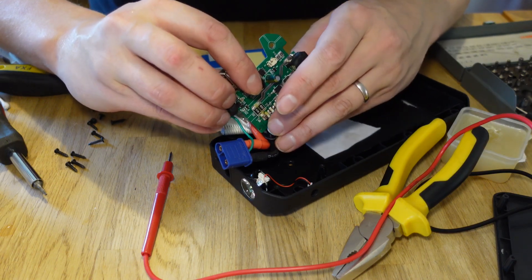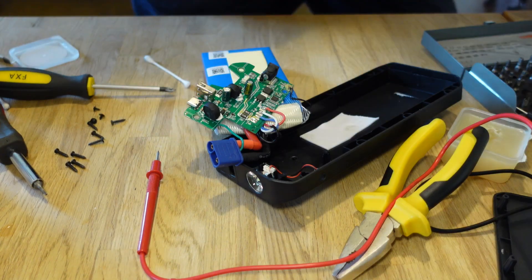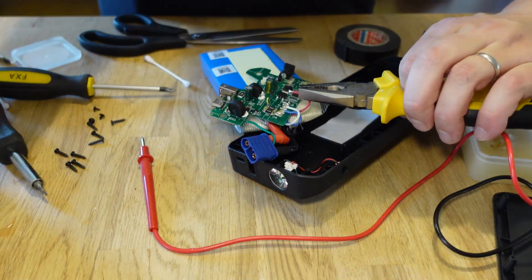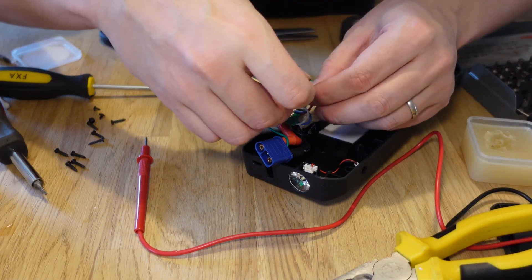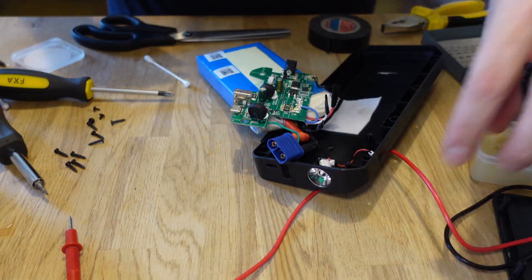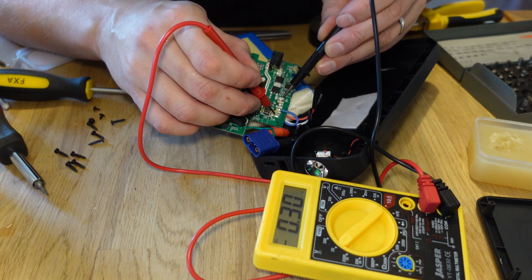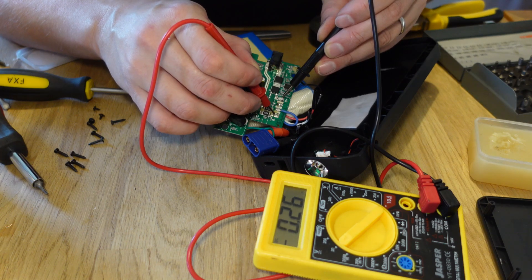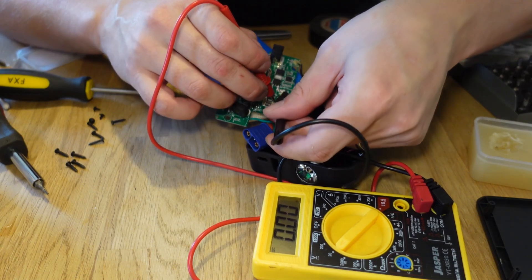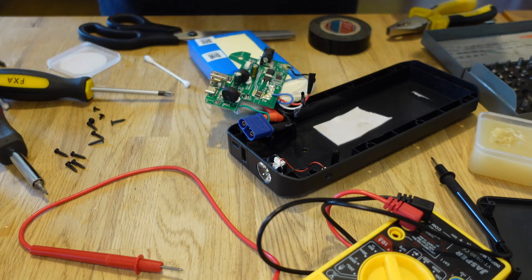Let's see what happens if I... I guess I need to disconnect more but I'll isolate this one. Now the board has no voltage from here at least. I'm draining it with the voltmeter — it's basically dropping from me measuring it. Probably some capacitor. I can just short it out for one second and be done with it. Okay, now I have shorted this, so whatever was left in the capacitor should be gone. Now I have to solder it back.